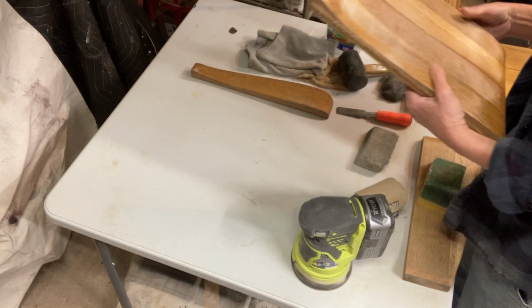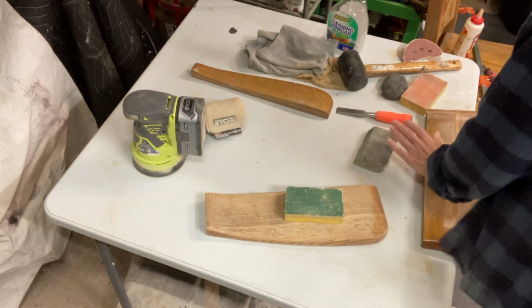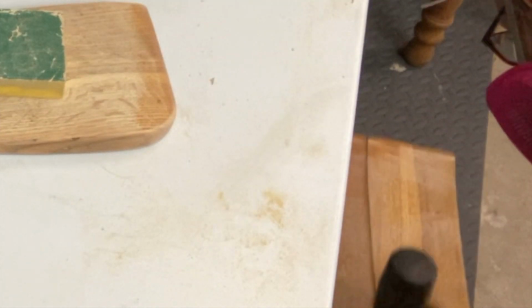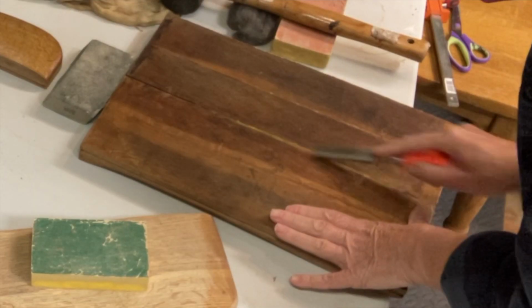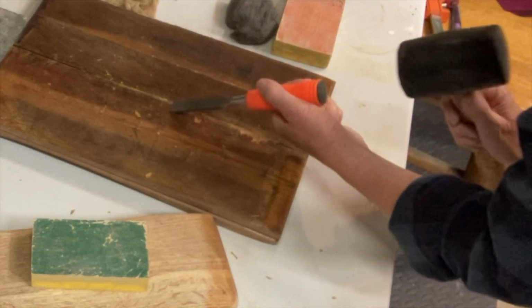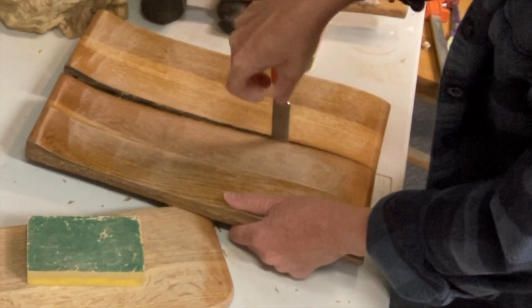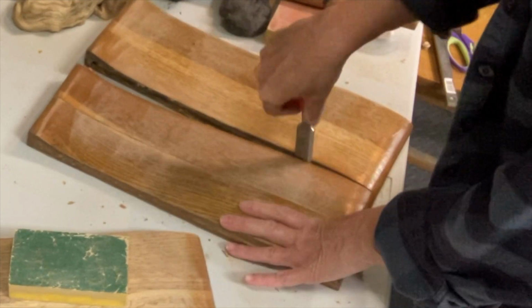There are cracks in this seat that are pretty big, and I'm thinking that I can probably get the dry glue out of there and make it fit a little bit tighter. So I'm trying to break it apart naturally, sort of, but it's not coming off because it's really glued on there good. So I'm using my chisel and my little mallet to get that glue off and then kind of pry those 2 pieces apart, because I'm hoping that I can clean out enough of the glue to get it nice and snug again so you won't even see the seam.